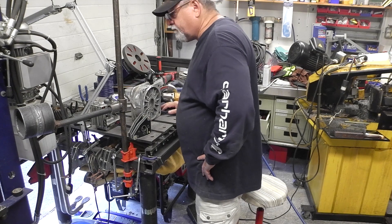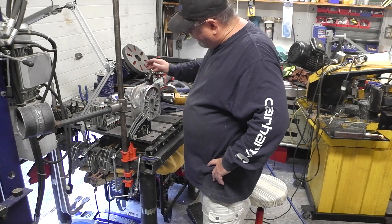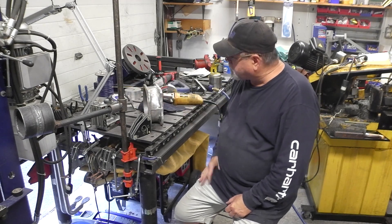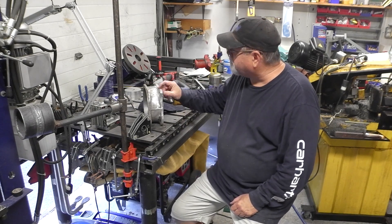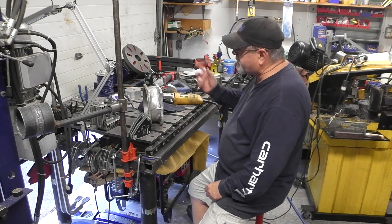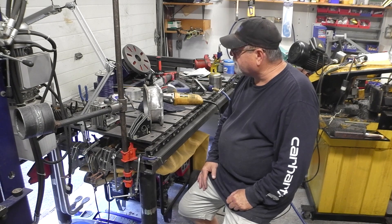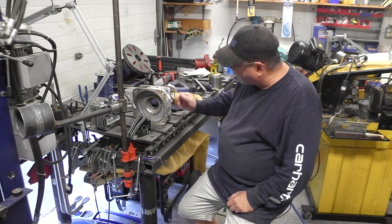So dirty. It's taken almost an hour and a half to get this thing to where it is right now. Never want to do this kind of welding again. I had that thing cranked up to about 200 amps - 200 was fine. I was probably using around 175-180. But it's because the metal is so dirty. And I cleaned it, ground it, wire brushed it, even sandblasted it earlier to get all the crap off it, cleaned it with acetone. And still, this cast stuff is junk. I don't like it, I don't like welding on it. But this guy was in a crunch to get this done, so I did it for him.